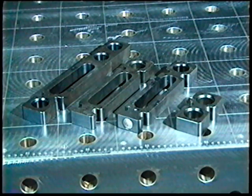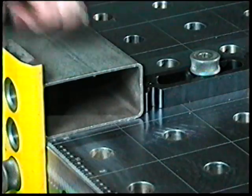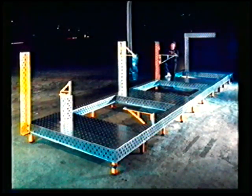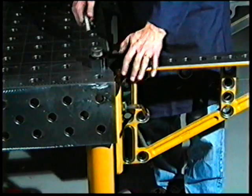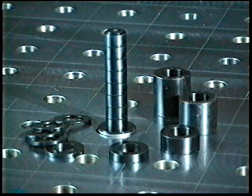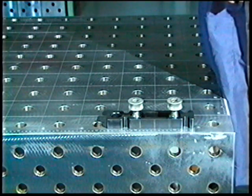Universal stops serve as locators and as gauging bars used in setup. They also hold the toggle clamps, V-blocks, swing clamps, and adapters. The universal stop with a spring-loaded button is used as a low-profile clamp. Angles and other elements can be used to extend the table surface. Two or more tables can be joined together for larger parts. L- and U-shaped spacer blocks can join tables where space between them is desired. Universal stops are securely bolted to each element before the joining PC bolts are tightened to ensure the joined surfaces are flat and square. The spacer set is a very versatile tool: nine rings of varying thickness and the head of the post provide accurate spacing when used as a support. The rings can also function as spacers between components. For gauging, the universal stop can be moved in precise 25mm increments.